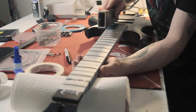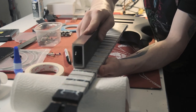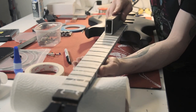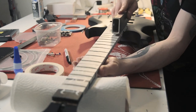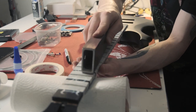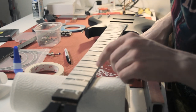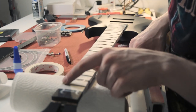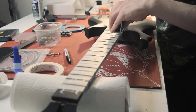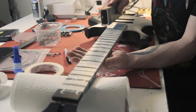The main thing here is that you do not press down at all — take very gentle strokes, just like that. Currently doing this with 240 grit. From here I can see there is a low spot here, here, and somewhere over there, so I need to get all of that sorted out before I can move on to crowning. Just take your time, you're not in a rush.